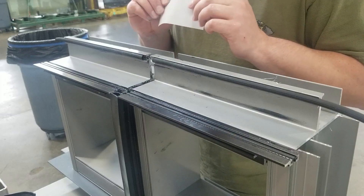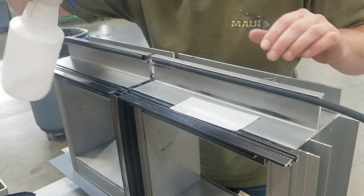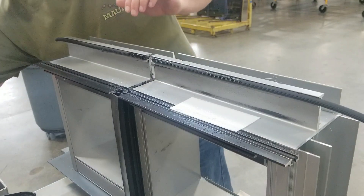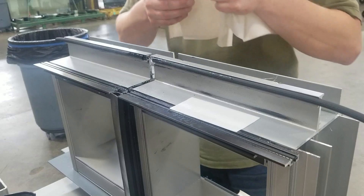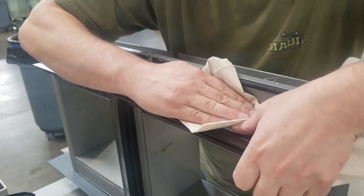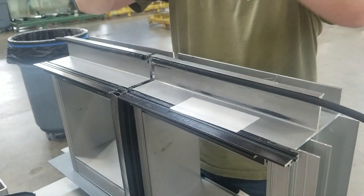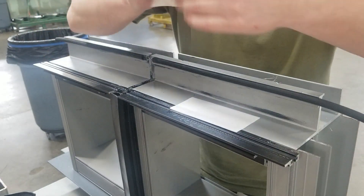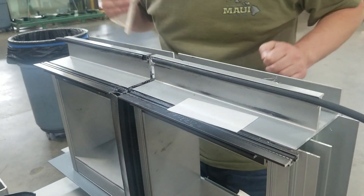Before we apply the silicone boot, we need to properly clean the boot and the substrate. We're going to use alcohol. I'm going to spray some alcohol on here, get it on the top of our unit, and then we are going to use what they call the two-towel method — we're going to take one towel in one direction, swipe it clean, and you can see that towel getting dirty. We'll take another clean towel and do another swipe over the top, making sure it's clean, free from debris, free from grease.